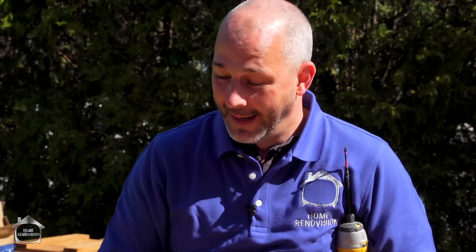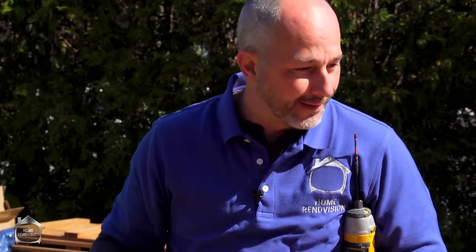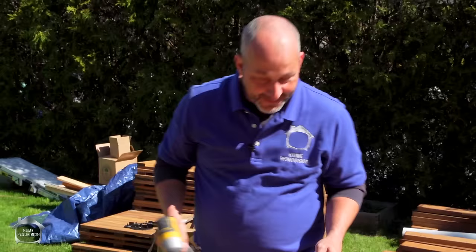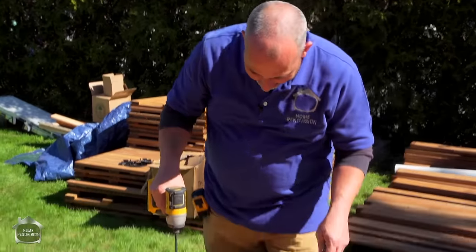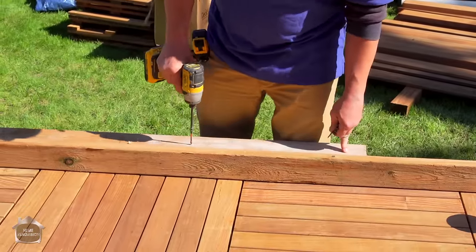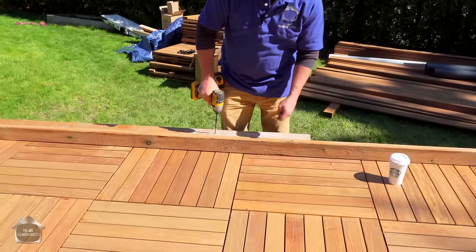Unfortunately, our slab is an unlevel surface. Hopefully, if you're building a pergola at home, you are working with a level surface, and then you won't have to do what I'm doing now, but I'm gonna teach you an amazing trick for whenever you need a level that's extremely long. What we have is 3 2x4s here. I've taken 2 of them, and I've just stretched them out the full length that I need, which is 190 inches, and in feet, it's just a whole bunch.